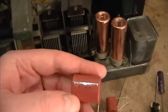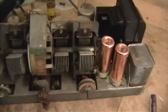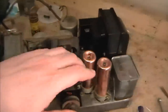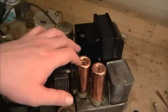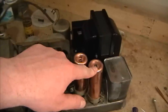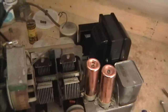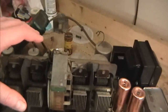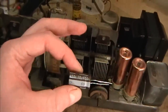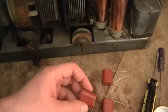More importantly, these are rated for 630 volts. I've put a meter on tube radios before, and when you first turn them on and that 80 rectifier starts conducting, the first capacitor — the one closest to the rectifier, next to the choke — gets hit with pretty high voltage, sometimes upwards of 600 volts, because the other tubes haven't started conducting yet to pull down that voltage. These caps can take a bit of a surge voltage without blowing out, but it does stress them, so that's another reason I was thinking of going with these.